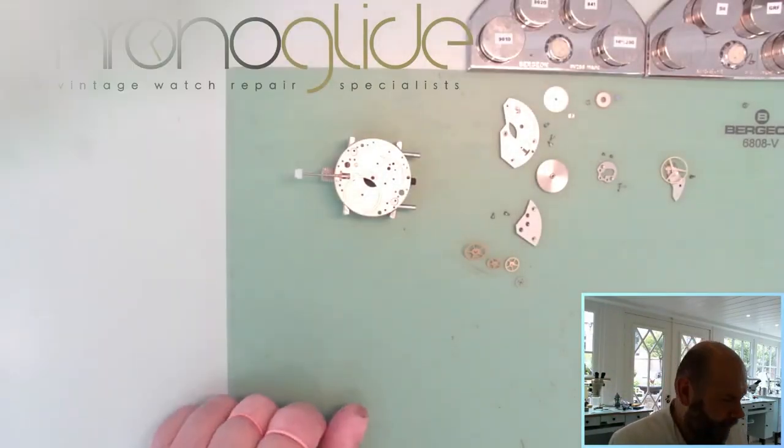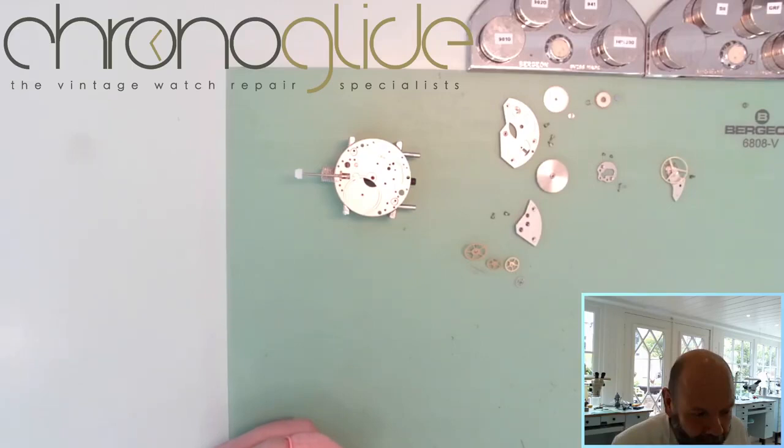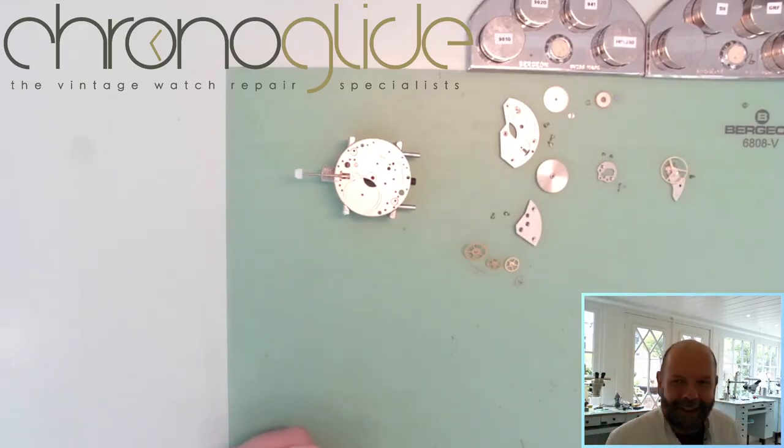I want to show you where to start — and I only make suggestions. If you're an experienced watchmaker and you've got your own way of working, done that for 10, 20, 30 years — excellent, I will never tell you to do otherwise. But if you're a hobby watchmaker or less experienced, this might give you a system to work from. For me it's a first-time-right system, because the in-between tests of all function groups will make sure all defects are found. Usually there are more than one — if you found one defect, never stop looking for the next. A watch is worn, a watch is dropped on a marble floor — anything can happen.